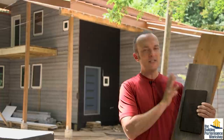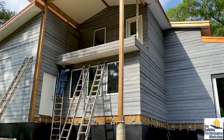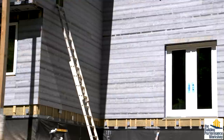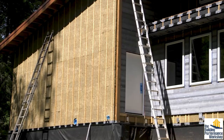What we have is wood — solid wood. All the wood being installed on the siding and on the decking here is kiln-dried Norwegian spruce. It comes in already kiln dried, then they shape it once and stack it on what's basically a railroad car that gets driven into a kiln. But this kiln is special — they cook it at 419 degrees Fahrenheit until the wood contains zero moisture, literally zero percent. Then they introduce moisture back into it with steam under pressure to get the wood back to four percent.